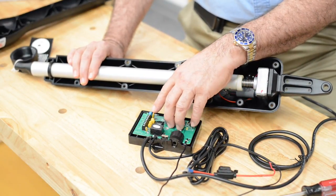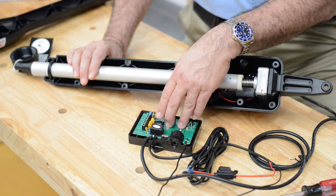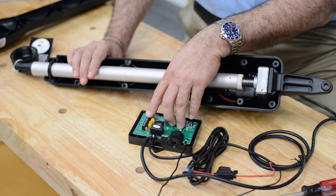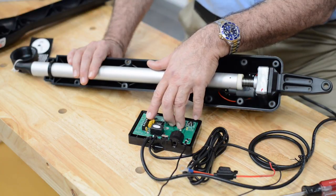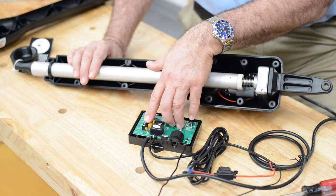The control board has terminals on it for adding your accessories. The charger comes in here. There's a safety circuit for photo eyes, an exit circuit for exit wands, push buttons, and loops, a cycle to open the gate, keypads, push buttons, and things like that. An edge, which is another safety device, and locking terminals.